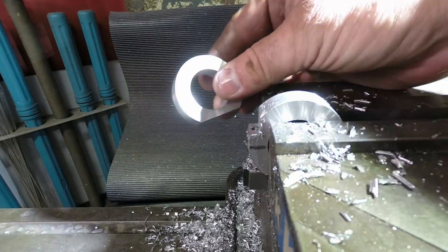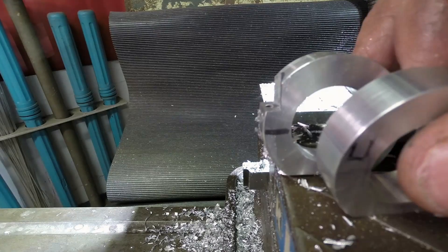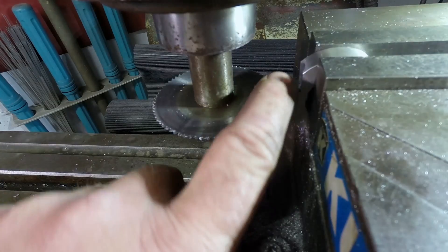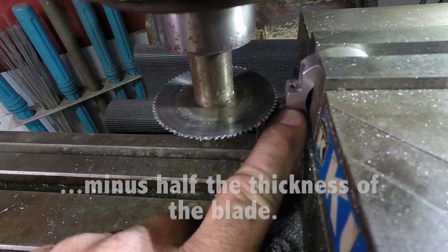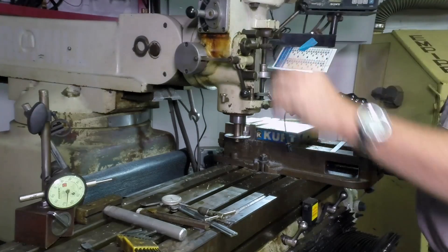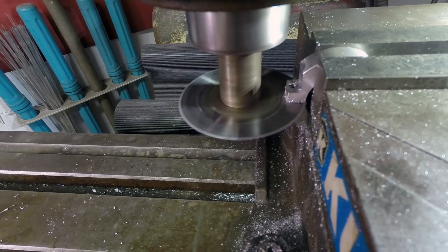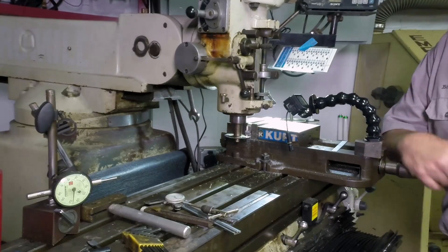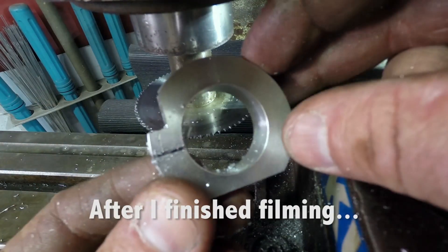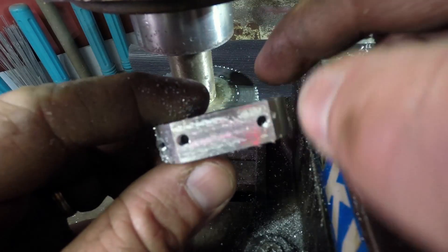So we went from this to this. Now it's time to put the parting slot in. Essentially from this flat land right here, we've come down a quarter of an inch. We've got a slitting saw in here and we're just going to put a nice relief cut in here — that'll allow us to pull that bolt and clamp it down. A little lubrication on here. So now the electric motor can sit through there; we'll put a screw through here, tighten this down, and bolt it in place.